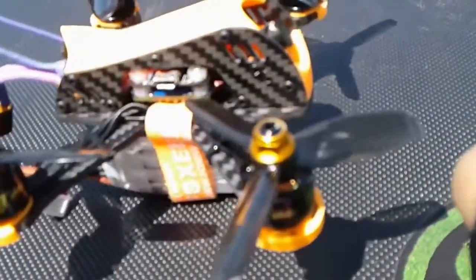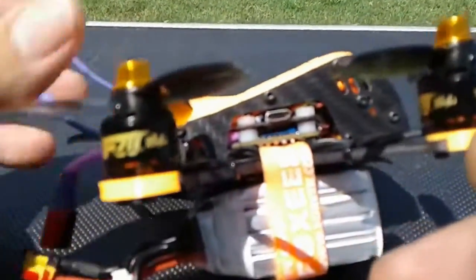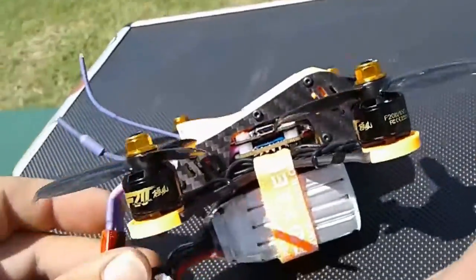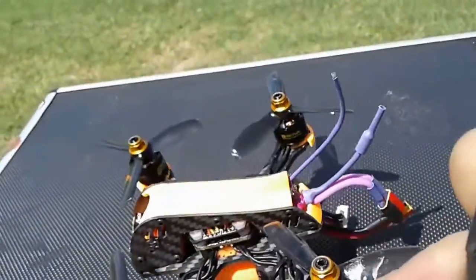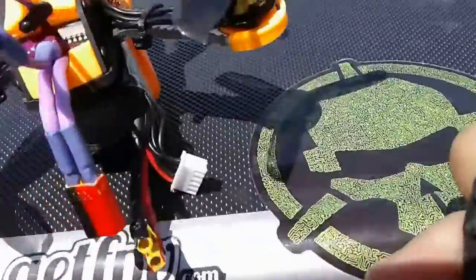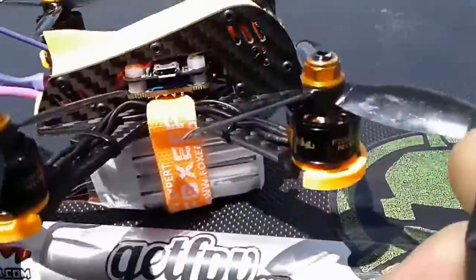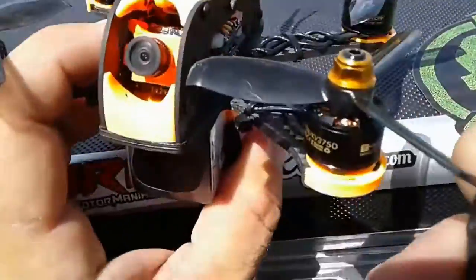I don't know how else I could have built this, but wow it's tight. I had to shave down the standoffs. I had to shave down that top nut on the rear just so it would clear the opening. I had to decase the receiver — it's the Flysky 8HS — just to fit that in. And I have the VTX kind of stuck in the back here. It is super tight in there and I struggled to even get a buzzer in there. There is a buzzer in there.